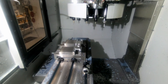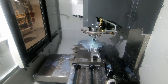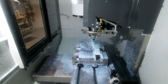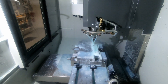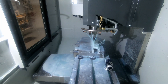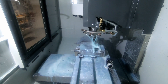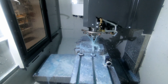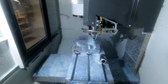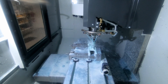High-speed machining on the Haas Mini Mill 2: 10,000 RPM, 250 inches per minute, half-inch cutter going the full quarter-inch depth all the way through the material. The cutter is made by Lakeshore Carbide — pretty much all my cutters are Lakeshore Carbide. They're quality, U.S.-made stuff at a reasonable price — at least I assume they're U.S.-made; I haven't seen the factory.